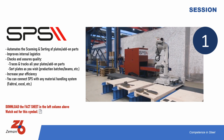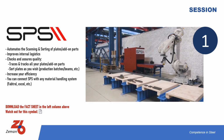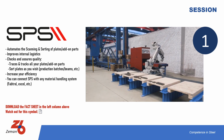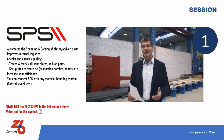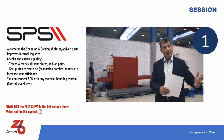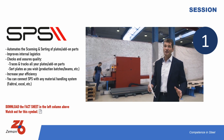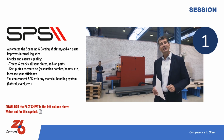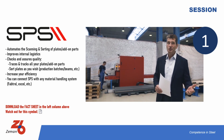Next question from Chuck, Illinois. What happens to parts that are out of tolerance? Good question. First of all, the operator here, like Matthias, will sort these parts manually with a bigger tolerance. And then he decides whether it's good to go for the manufacturing process to the SBA, the steel beam assembler, or to the manual fitting and welding station. If it's really out of tolerance, then it goes to the fallback box, what you have already seen. And at a later stage, the operator can decide what to do with these plates, whether to use them or rework them.